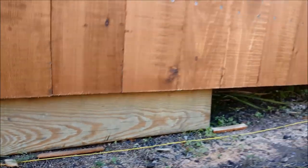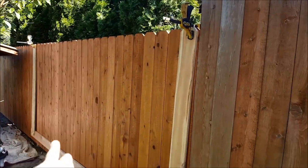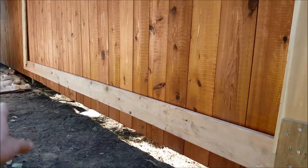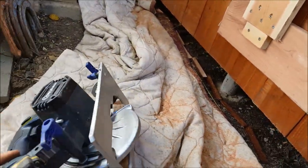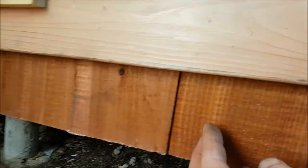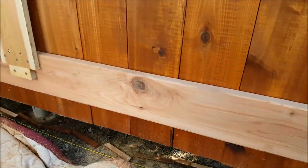To accomplish that, I simply used two old pickets and a straight, true cedar board — you could use a piece of steel or anything similar. I clamped it up on top; I know my tops are nice and true and straight. Then you take a circular saw — I've got a battery-powered one — make your adjustments for your fence, get down on your knees, and just run the circular saw across the bottom.